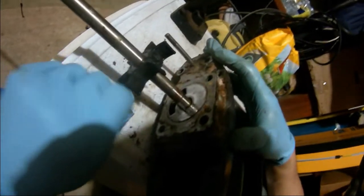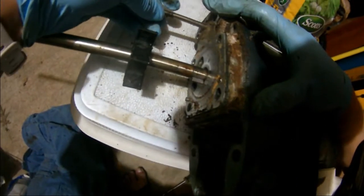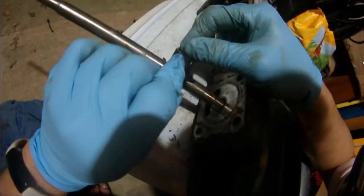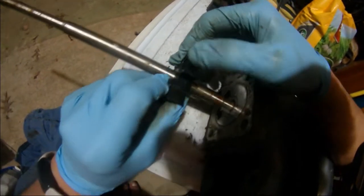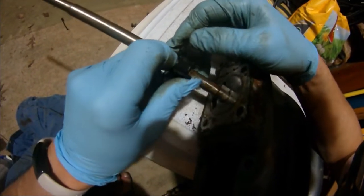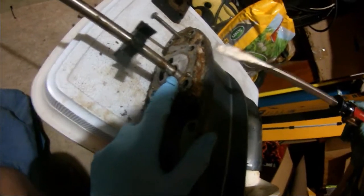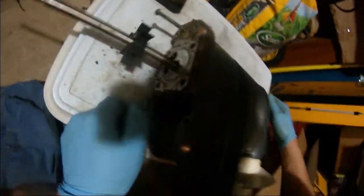See, that's the key there. I don't want to lose this nut, so let me put it back. Let me see if this impeller needs to be replaced. The blade looks good — the blade looks good. The key sticks on that thing really good. I'm kind of surprised that the water stopped shooting out. This thing is certainly very dirty. I'm just going to clean this up and then put the impeller back in, and then that cover back in, after I clean the dirt out. Let me take a picture of that.